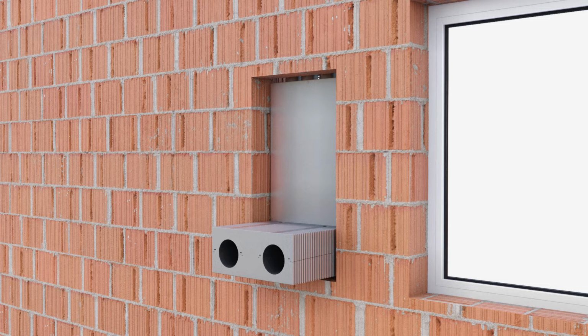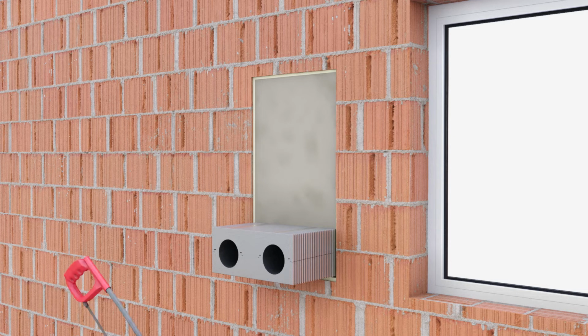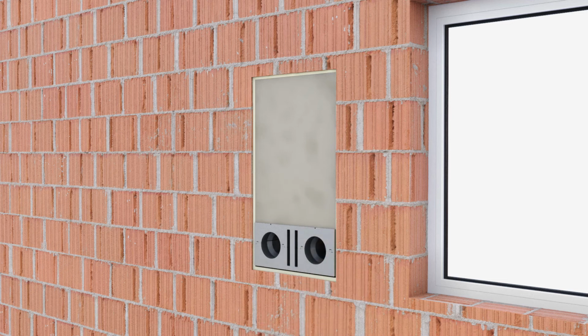On the outside, the area behind the flush-mounted housing must be sealed by means of an ETICS compensating insulation, fixed with adhesive foam. With a brick thickness of 250 mm, it is flush. When the compensating insulation has been fitted on the flush-mounted housing, the wall duct must be shortened so that it is flush with the masonry and the compensating insulation.